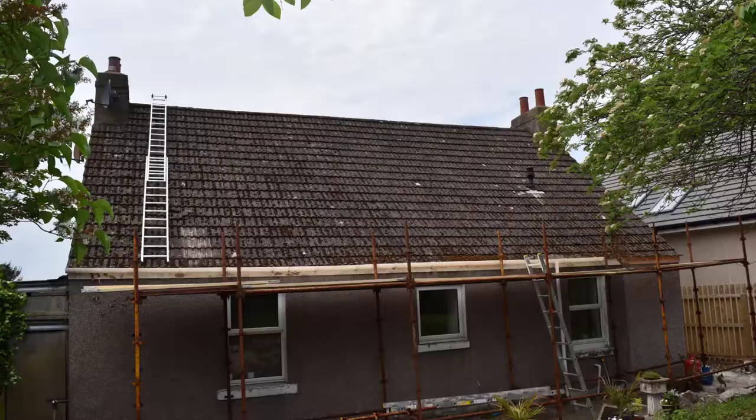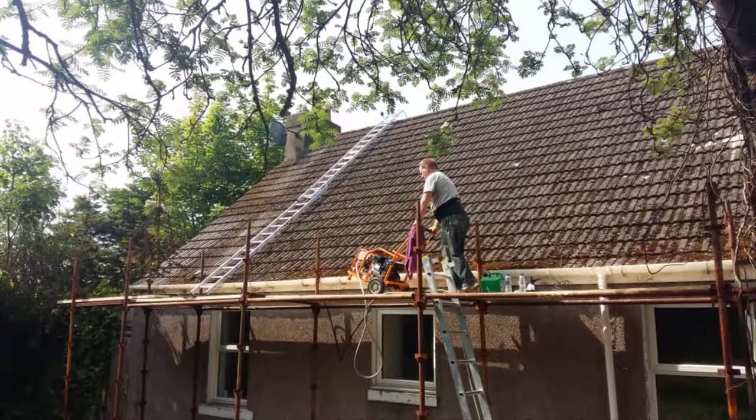I also invested in a roof ladder, which is essential because you're climbing up and down the roof and you need something to grip onto. The first thing to do was to remove the moss. The advice I was given was to brush the moss off, but I found this extremely difficult and very time consuming. After only doing a very small part of the roof, I decided to go for a different method and power wash the roof, doing about two or three rows of tiles at a time.